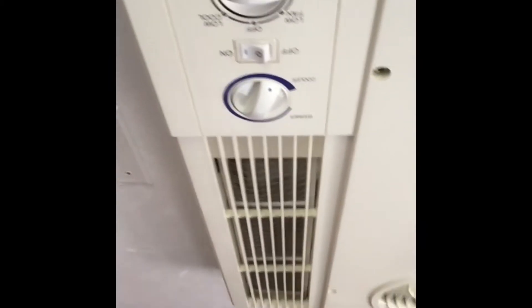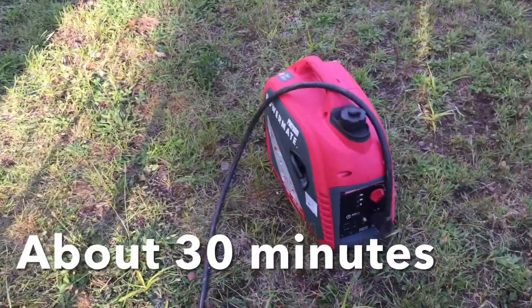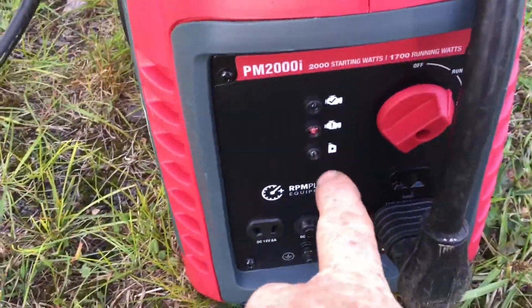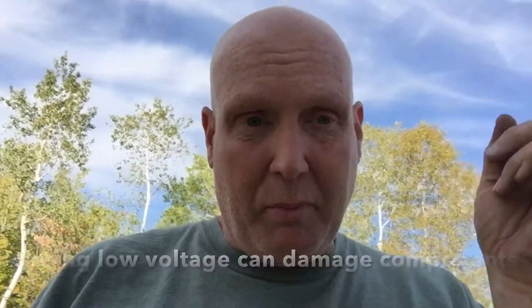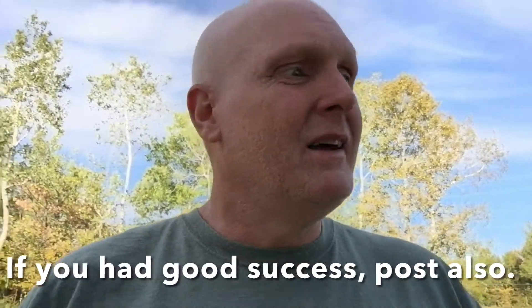Short term, I'm going to say it was a success. I've been letting it run for a little while with it on high at max cold, and it just revved up a second ago and it actually kicked out. So long term, I don't think this is the solution — the generator is just a little too small for the AC. I don't want to wreck anything, so I'm going to put everything back the way it was and look into a bigger generator. It did run for a little while, but once the compressor gets all the way up to pressure, cycles out, and comes back on — that's when it kicked out. It was a good try and a cheap test, but in the end it didn't work.